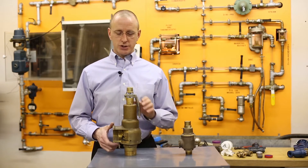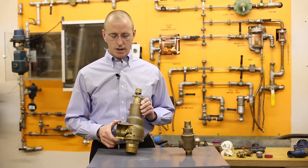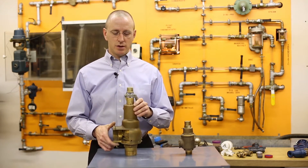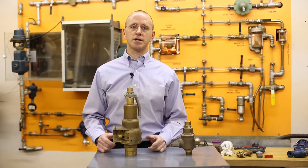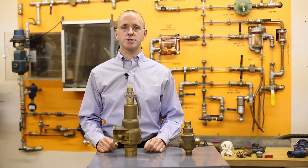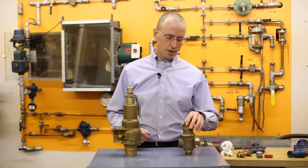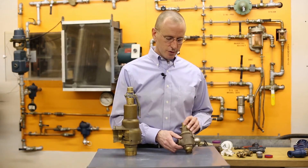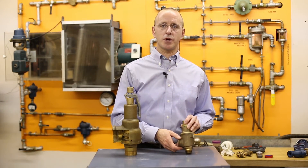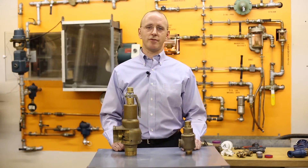Where would you find these valves? For Section 1 valves, for steam, you'd find them on high pressure steam boilers. For Section 8 service, you'd find them after pressure reducing valves. You'd find them in processing plants, any of the high pressure steam boiler plants — hospitals or other food processing plants. The liquid valves you'll typically find either after pump bypass applications or after pressure regulators. And these are safety and relief valves.